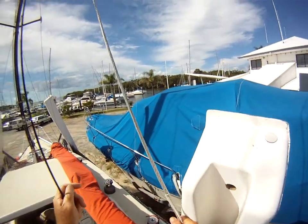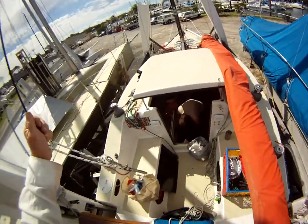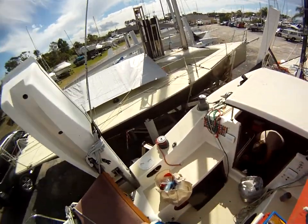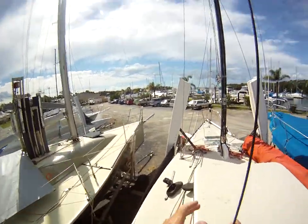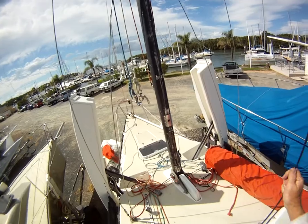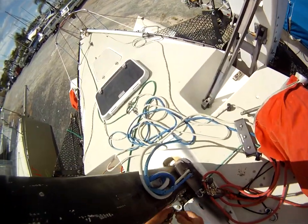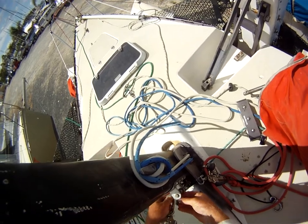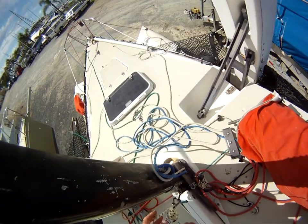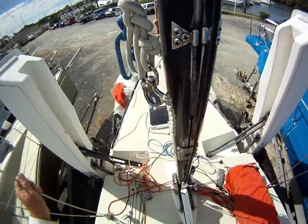The backstays, you'll notice they're on firm. I've just got to release them to get them out of here when we drop the mast. So this topping lift, there's wifey working inside. This main topping lift just goes straight and secures on the boom vang back position. Gets it out of the way. Once again, it's one of those things, if you stick to it, it will be a good thing.